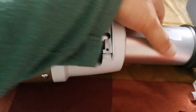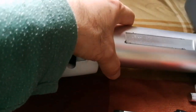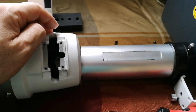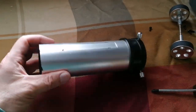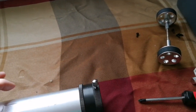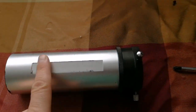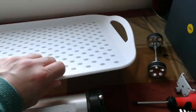The focuser tube now comes out. I remove the optical tube assembly and cover it so it doesn't collect dust. Now I put the focuser aside - this is the tube, and as you can see inside it's completely blackened. I can remove this part, put it in a vise, and with the tool I'll flatten it slightly.